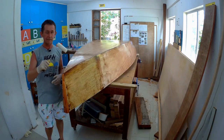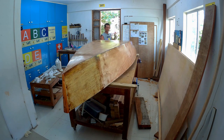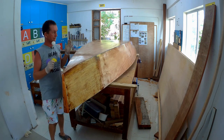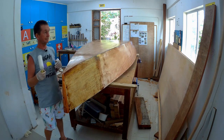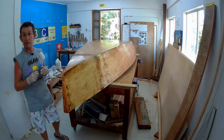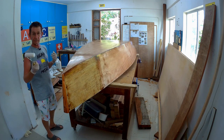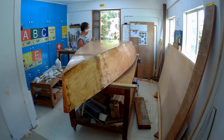The roller job really worked out well — a lot better than I expected. The roller seems to be good quality, which is unusual. Now, the next job I'm going to do before this gets tacky is put the fiberglass on. We don't have tape because we can't get tape, so I've cut the cloth into two-inch strips diagonally from normal cloth — 200-gram cloth, which is six ounces. It will take a little bit more epoxy. I'll put on an extra little bit with the roller.